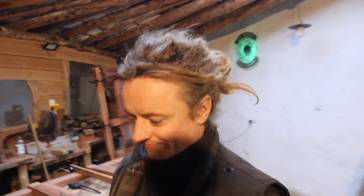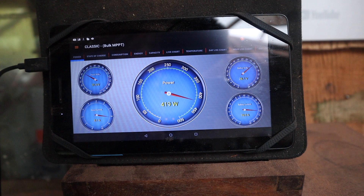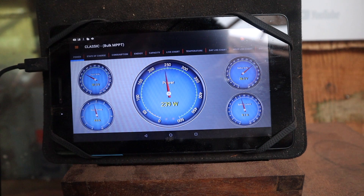It is the next day and I'm just in the workshop working on the doors. The power went all night last night and it's raining again today, so it's a good chance to do a full power test. It's on three nozzles at the moment running at about 420 watts. I'm in the workshop all day today working on doors and Dot's making jams — it's going to be a high power day. Let's see if we can run this with all the nozzles on. I'll just put valve one and valve two on and see if we can get back up to full power, between 460 and 480.